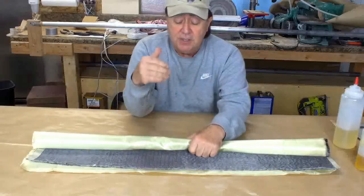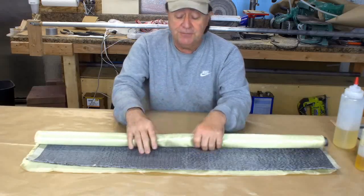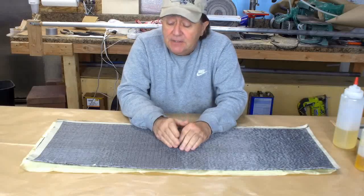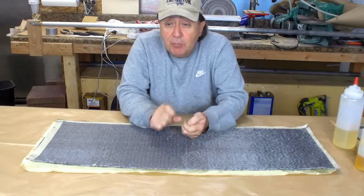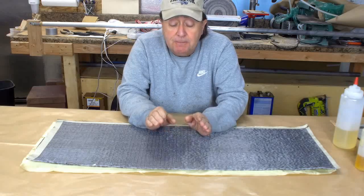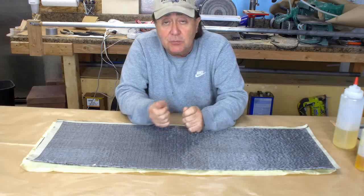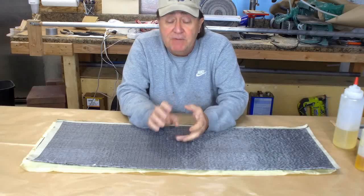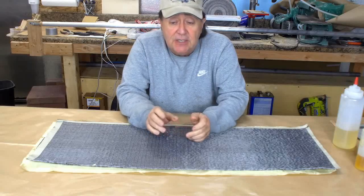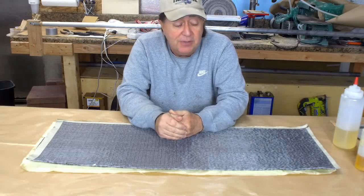It's going to be carbon fiber, Kevlar, carbon fiber, Kevlar. The outside surface is Kevlar. The reason for that is safety. If you've ever broken a piece of carbon fiber, especially tubing, it is, well, like a weapon. It's really a spear. The ends can be very sharp. Shards will fly off that are sharp as needles. In a crash, it could definitely be a deadly weapon.